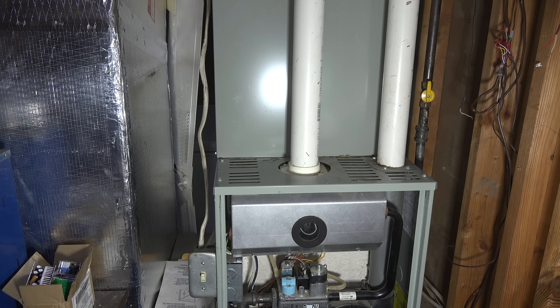Here's your situation: your furnace stops working, maybe the fan's running but there's no heat. You look in a little window on the fan cover and it blinks a pressure switch code. A lot of folks — DIYers or unfortunately some service techs — immediately decide the pressure switch has failed and replace it, and of course it continues to do the same thing.